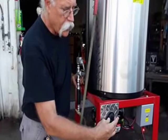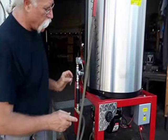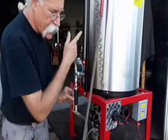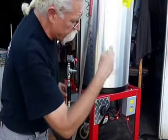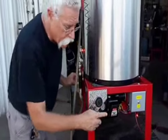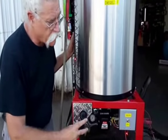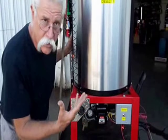My light indicates that the flow switch is turning on the relay that actuates the temperature control and the fuel solenoid. But if I don't have the temperature turned up, the next light doesn't go on. I'm going to show you that if I actuate the flow switch with water flowing, that enables my temperature control. If I turn up the temperature control, I get flame, and the relay light turns on because the control circuit is confirming flow, the temperature control says it's okay, and I've got power getting to the relay that turns on the high voltage and the fuel solenoid.